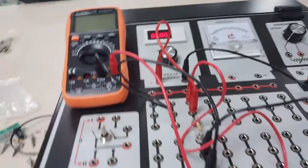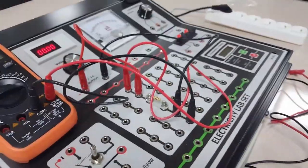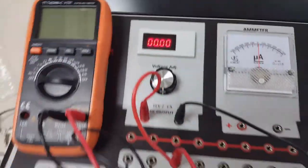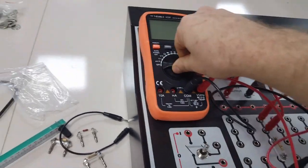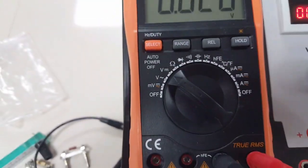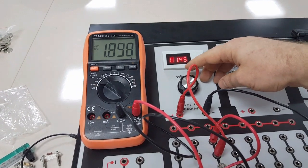In part C, we will be measuring the voltage level. Our voltmeter, the multimeter in the voltage mode, will be connected, as you see, parallel to the resistance. Now we will be giving power to the circuit with the resistance connected, as you will see here. And we will compare the level with what we measured in the related section of your paper. Now we open the multimeter in the DC volt measurement mode. Now we will be giving 5 volts from the digital power supply.